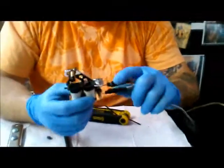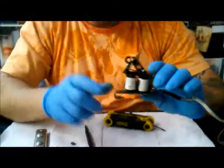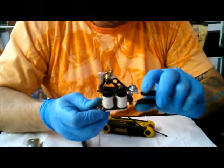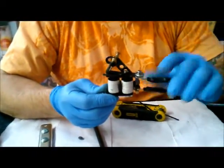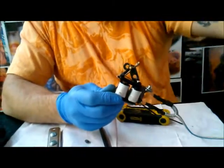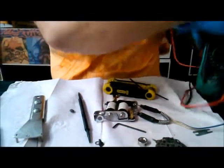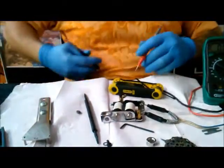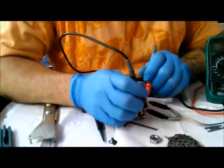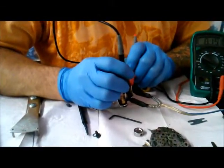Okay. So anyway, clip cords and various other factors will make this machine run more or less efficiently. You get a voltage on your machine that says 6.2, like this one does. And if you want to check that, I mentioned earlier a multimeter, you can take this machine, turn it on, and set it to voltage, 20 volts, and turn this on and see that we're running at 6.10.